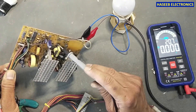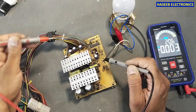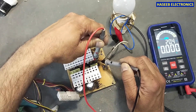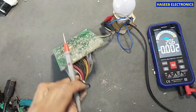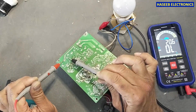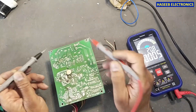It also provides 12 volts. If this signal transistor is damaged, because it takes 12 volts from this small power supply, you can check the voltage on this diode — there is no voltage. And we can check the voltage on this capacitor — there is nothing. We have supply here at the input but no supply in this standby section.